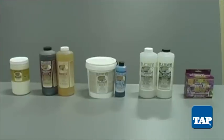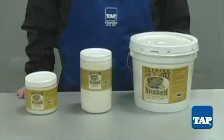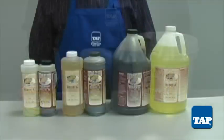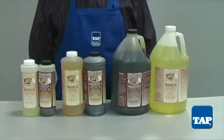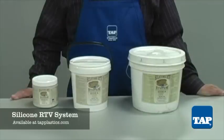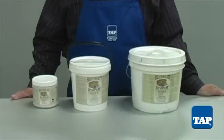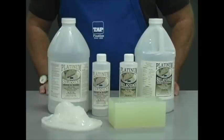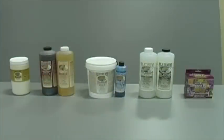So, which mold material is right for you? There may not be one right answer — it could depend on your personal preferences. If you want something simple and economical, have a simple mold shape, and have a lot of time, then latex makes sense. If you want a tough mold and don't mind working with mold releases, then urethane would be a good choice. If you want to eliminate mold release steps, want maximum flexibility, and want to keep your labor time to a minimum, then one of our silicones might be right for you. Whichever one you choose, you will discover the need to practice and experiment — and in no time, you will be enjoying professional results.